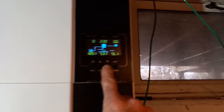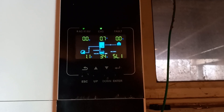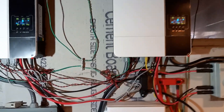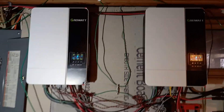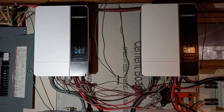We're getting almost no amperage — like one amp, 0.4 amps right there. So it's just not enough to charge the batteries on a cloudy day, but on a sunny day, no problem at all. It charges those things to 100% with no issues from my semi-small array — 20 total panels.